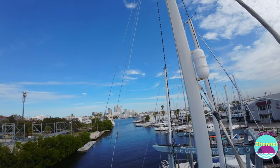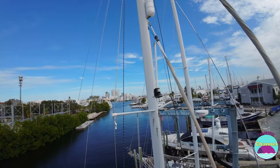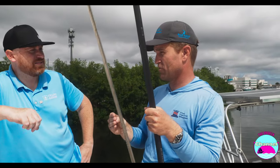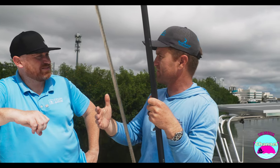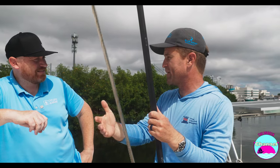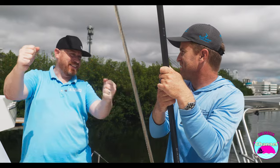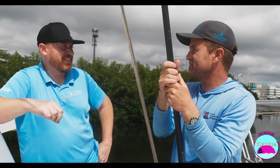It doesn't necessarily mean you absolutely have to reef at that point — it might really help some people with sail trim. If you're just over-sheeted, ease the sheet and watch how those numbers rise and fall. It will very likely teach people to sail their boat faster, because the more experienced among us know that when you're over-canvassed you're pushing more water and making leeway. People often feel like they're going really fast when the boat is dragging sideways a little — like a heeling monohull with the rail on the water, you're not necessarily going faster; you're just over-canvassed or over-sheeted.